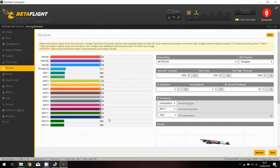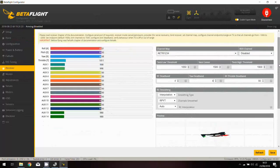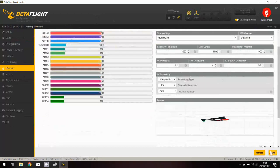No activity in aux 12. Unfortunately, we will apply whatever some dead band. Okay, and be sure that all your channels are centered more or less about 1500, and we have nothing above 2000, 1000 to 2000, sorry. So everything is here. Okay, we can save.